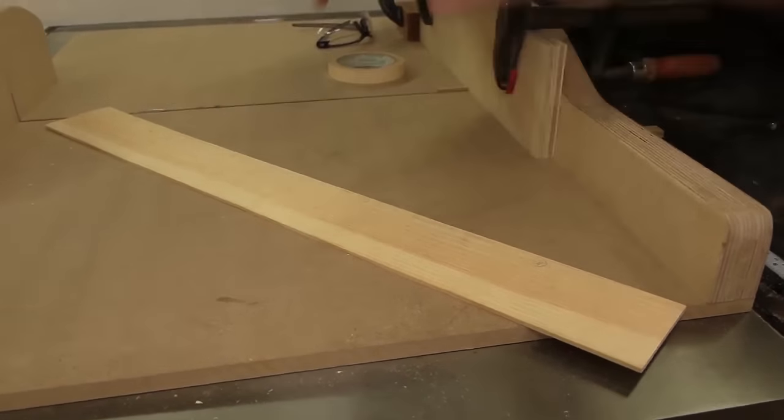So you can see once you have your setup, if you've got whatever material you're using, plywood, whatever, run a bunch of stock, run all your parts, whatever. You get them all sized for your boxes. You set up that tooth system there and you are ready to cut some finger joints all day long. You just lock them out. Then you have a little glue up party and you're gonna have amazing boxes. Like making this basket is not that time consuming once you get your parts. You could make them quite efficient.